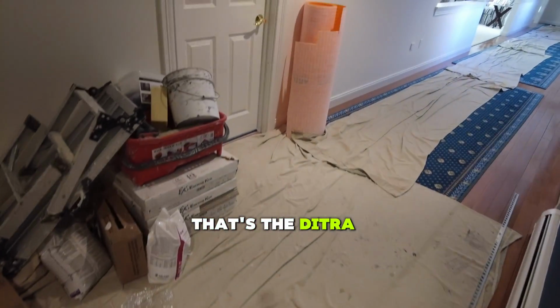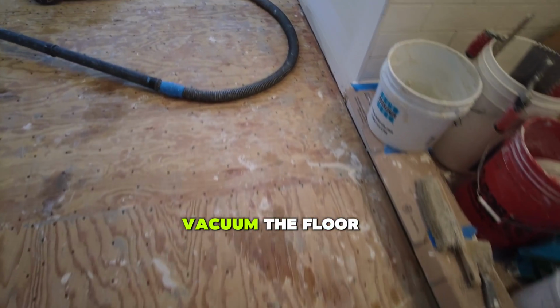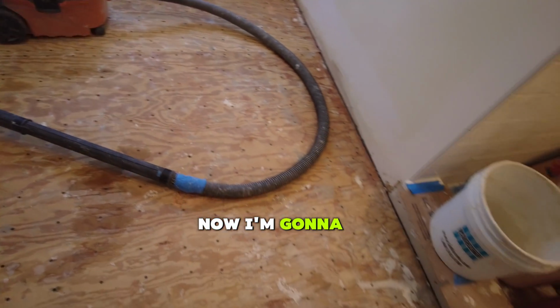Ditra's over here. That's the Ditra over there. Uncoupling. It's very important. Make sure you vacuum the floor and get all the dust off it. Now I'm gonna wipe it down with some water.